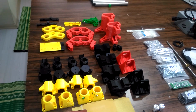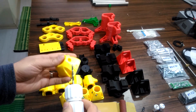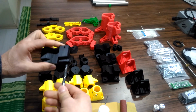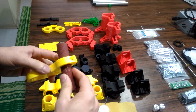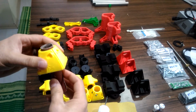The plastic parts, I have printed them from PLA filament as it was available in my hand, so don't bother with the colors. I mentioned in the previous video the pieces and the holes may come a little narrow according to your 3D printer accuracy. For me, I widened the narrow holes by using a drill bit with a diameter of 3, 4 or 8 millimeter, suitable for each hole. And I also sanded several pieces to fit the tube. They came a little narrow, as I said, so with a little sanding they fit perfectly.